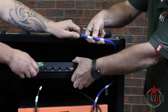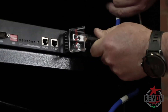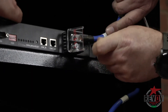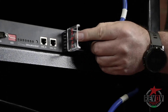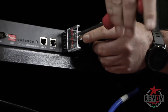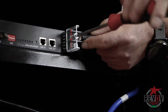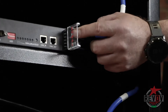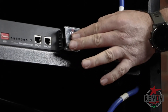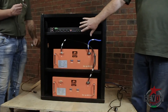You'd ask the guy to hold it for you as well because it's quite slippery. Then basically we'll install that like that. Just make sure when you're turning it in that you don't cross-thread, so it goes in easily like it's going in now. Once you've firmly tightened it, you can close the lid again. We have now connected the negative to the BMS.